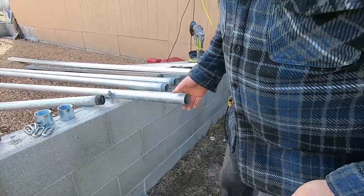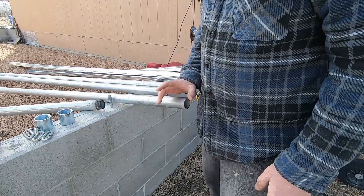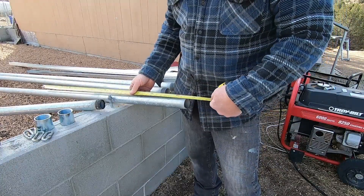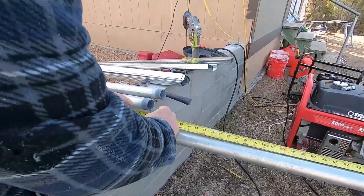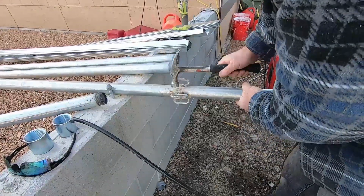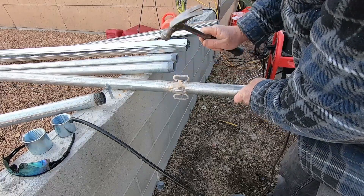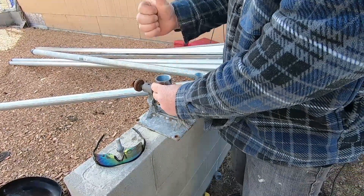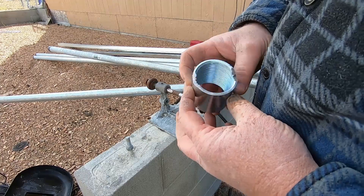In case you're wondering, I cut this end off the threads because this is where my turbine is going to go. The blades are seven foot in diameter, so we've got to measure from here down far enough where it will clear the blades — we'll go four feet, that'll give us plenty. This is not a real high stress part; this is only going to hold the wind generator vertical and only occasionally will it be lowered.